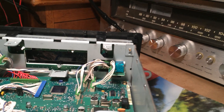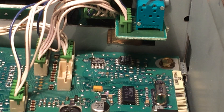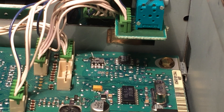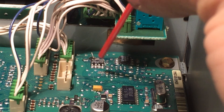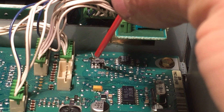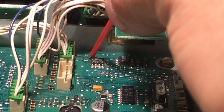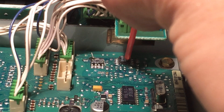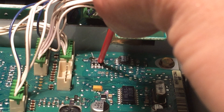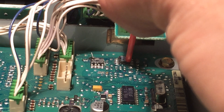The chips that you removed in the other video are back here. As you can see, the two chips in this radio are not in line with each other. This is the security chip on this radio right here. As you can see I damaged it - I had actually originally tried to remove this chip and didn't get very far. I tried pin 8 on this side and it bricked the radio, so I re-soldered the chip. I'm not sure what this chip is but these are the two chips. In the version it's okay to do this to, when you remove that chip it will unlock the radio - and the chips are side by side.